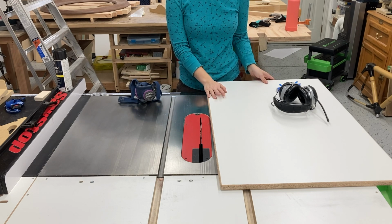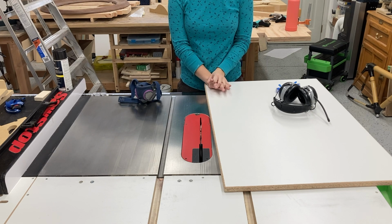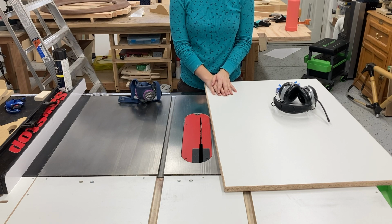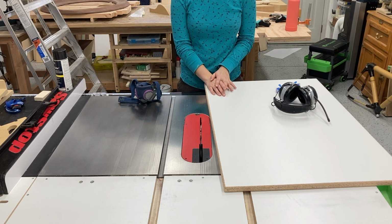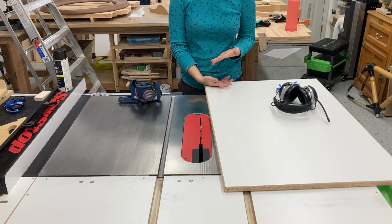I thought I would show you guys how to make custom sized platens. So the school already has platens, one that's 4x8 and one that's 4x4, which match the size of our vacuum bags. And those work really great for any time that you're doing a flat veneer press because you don't really need any additional height in the bag.